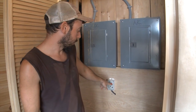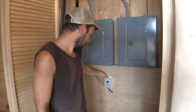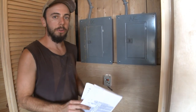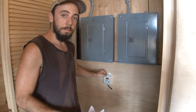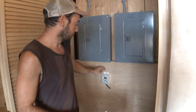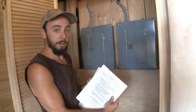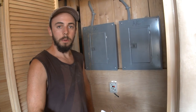You can see it just dropped under a thousand watts — now it's at 955 watts. What I really want to talk about is the percent full. This is a representation of amp hours from full. The way this thing determines a 100% battery charge is based on parameters that you set. There's a charged voltage set point and a charged amperage set point, and the manual tells you how to derive those — it's based on the specs that come from your battery manufacturer.